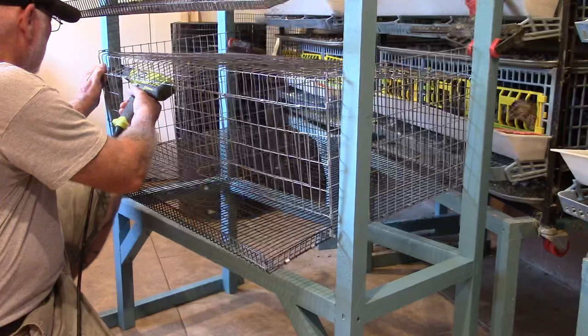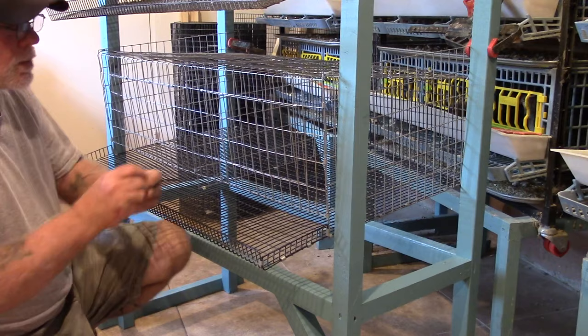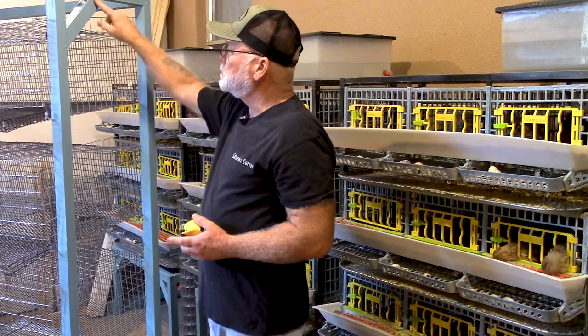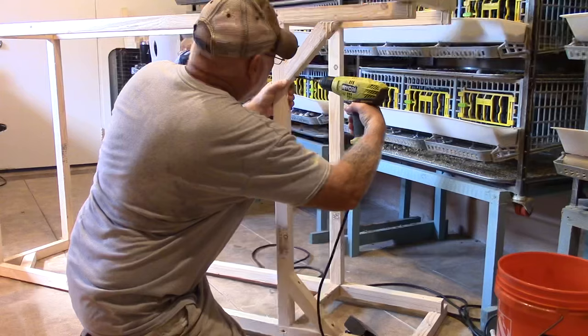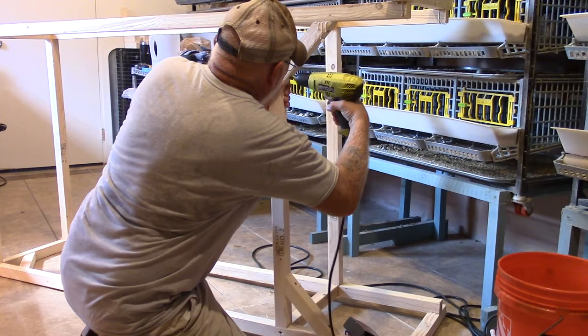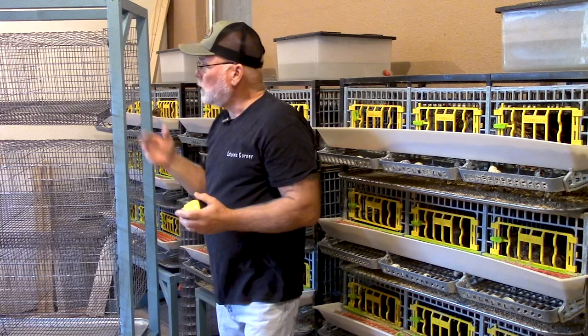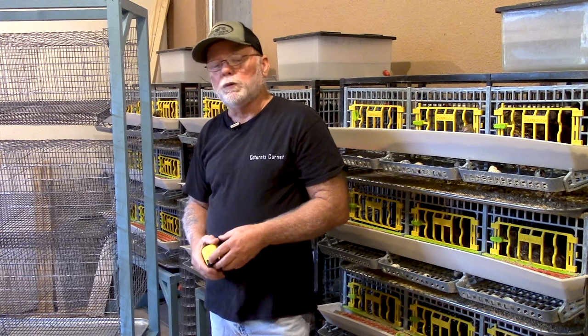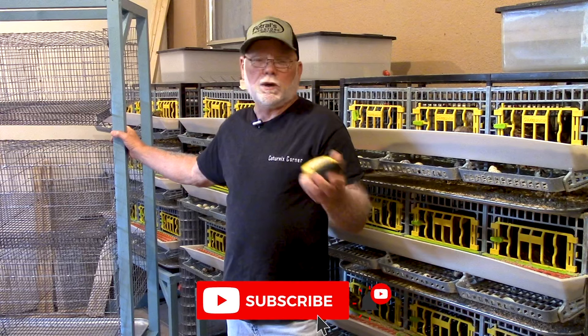So I think that's about it, guys. I just wanted to show you how I put these frames together. You're going to have a brace going front to back on the side, and then down on the bottom you want a 45-degree angle brace going side to side, so forward-and-back motion is restricted by the base and side-to-side motion is restricted too. I hope this helped — I've had quite a few inquiries about measurements and how to put these together, so I thought I'd do a quick video. Thanks for watching today. If you're not already subscribed, subscribe and hit that bell so you'll get notifications of new videos. We'll see you on the next one.